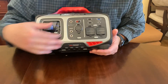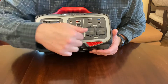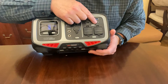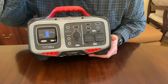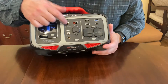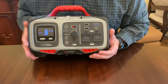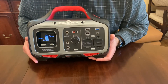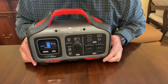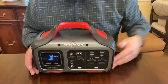The DC outputs are regulated, so as current goes up the voltage stays constant — a really nice feature. There are buttons to activate the different loads once connected. We also have USB output ports, a QC 3.0 port, and a 45-watt USB-C PD power delivery port. You can charge the unit with the included DC charger or a USB-C PD charger simultaneously, which is faster since charging with just the DC charger takes about seven and a half to eight hours.